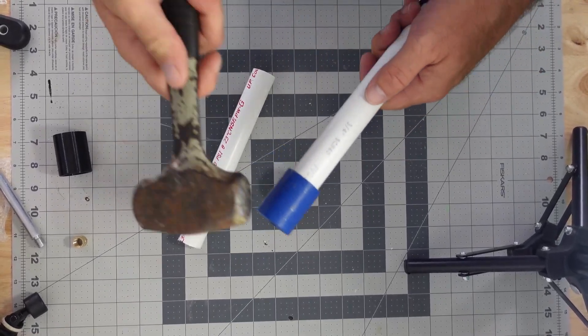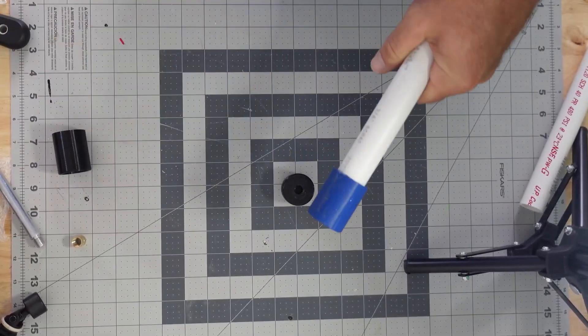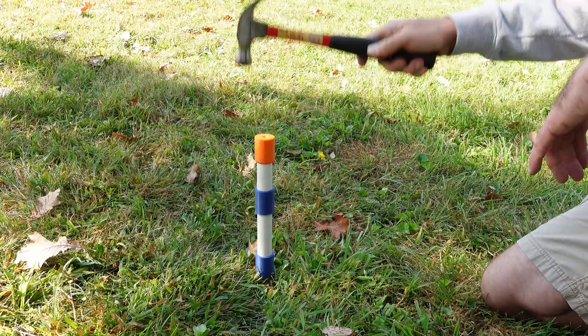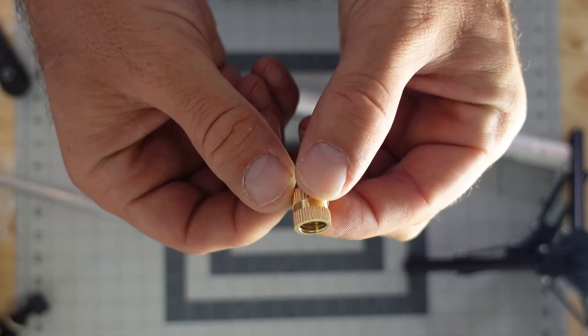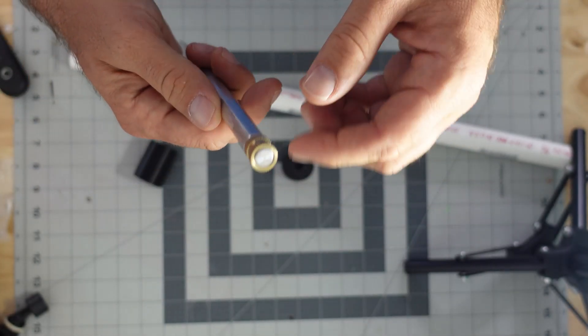If you're going to use this out in the field, you want to make sure it's going to be durable and hold up, so we have to run things through torture tests to confirm that. One thing I heard about 3D printing is if you throw it against a rock, it may break — but if you throw a lot of things against rocks, they may break. I ran this torture test anyway, and my results were wonderful. It should be pointed out that the weakest part appears to be the threaded M10 stud, which in the future I might fill with epoxy or add an insert into the cap.